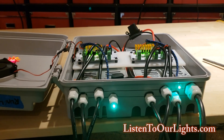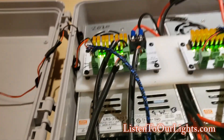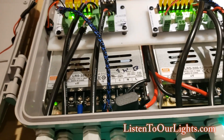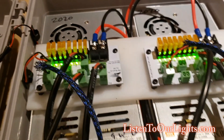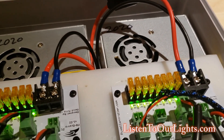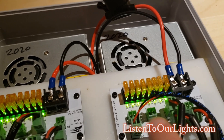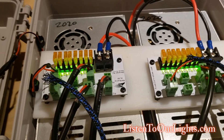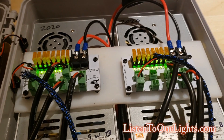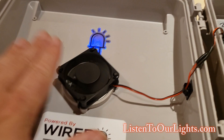I have a little checklist that I run through each year to make sure everything's in good working order. For anything that has a power supply, I go in and make sure all the connections are really tight — make sure the connections are tight up here, that red and black aren't reversed, because that obviously would cause problems. Check for blown fuses. Make sure the fans are working.